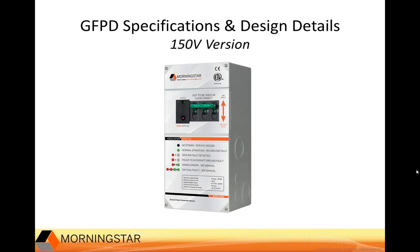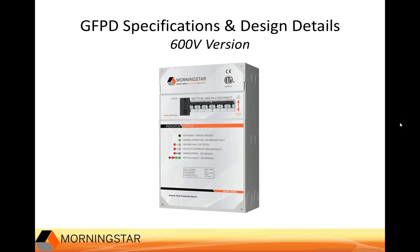Now here's a closer look at the 150-volt version. You can see here we are breaking both legs. When this trip breaker is thrown, it takes the positive and negative of the array with it. And the 600-volt GFPD is larger but works much the same way as the 150-volt. In this case, we have gang breakers to isolate the positive and the negative of the array.